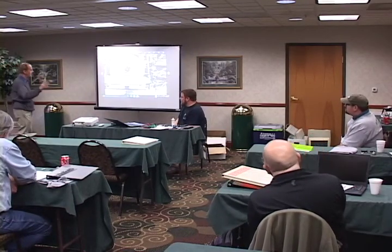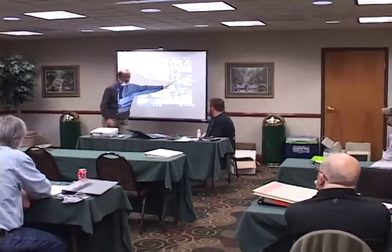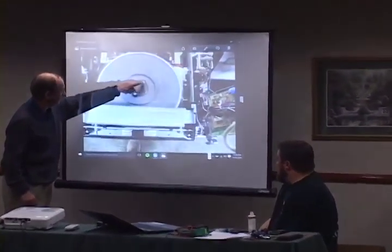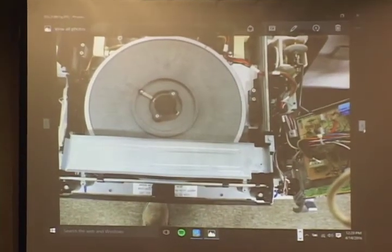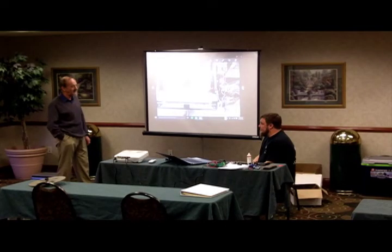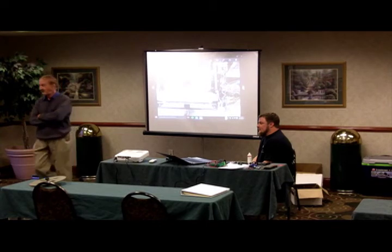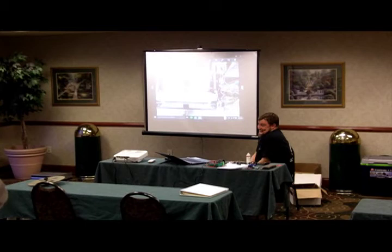Ryan will show you later how this goes, but in order to get to the turntable, fold back this power module that sits on the top and take this plate off, one screw. Here's the problem, the two yoke screws. If you don't use a well-pointed Phillips screwdriver, they might burr over and you have to drill them out. It's one of the worst parts of servicing the turntable. I've drilled them out before. I think I had one screw saved and then I super glued the other side.